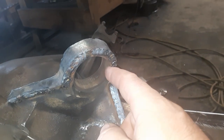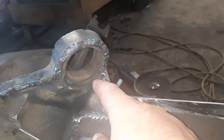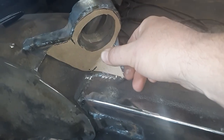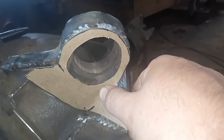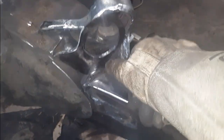I'm happy with the way it turned out. I managed to stay out of the bore for the bushing, so that's always good. Going around this plate, I'm gonna come around the outside of the edge. I'd love to weld on the inside but I really don't think there's gonna be enough material to stay out of that bore, so I think I'm just gonna weld it on the outside. I may make my hole a little bit bigger on the bottom and weld around there just to give it a little more structure — the more you can get on this, the better. I'm gonna start building a template for that.